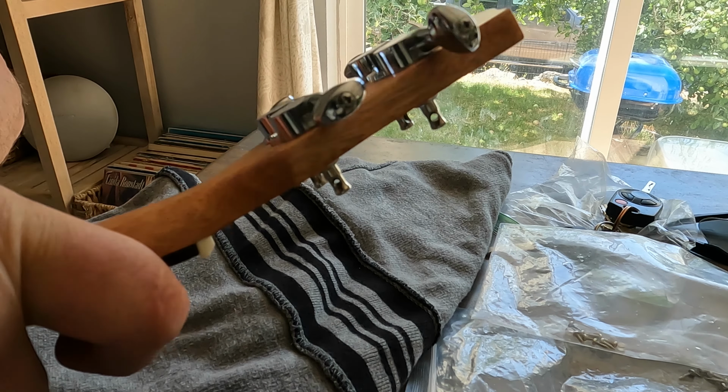Now you can see I have the sides welded on already. I used a much thinner type of steel for the sides. I had to form all these by hand, the sides, and it took quite a bit of work. And welding the thinner sheet metal was a bit of an adjustment. I've welded thin material before, but I had to use a TIG.